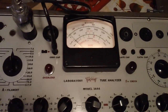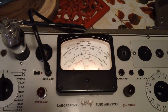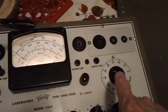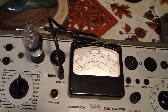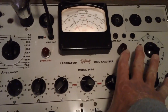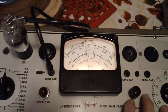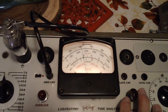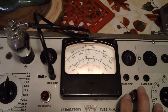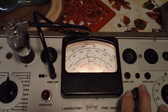It reads really good. It was supposed to read 0.1 to 1.1 or something like that — it's way up there, it's real good, we're in good shape on that one. Now, according to Norm, a small voltage change on the grid should cause a large movement in the needle if it's a 77. I'm going to pull this knob with my thumb and then just barely move the voltage wheel with my finger. I'm at 14... now 15. Nothing's happening right now — it's going down a little. Let's go the other way. Down to 10. Not a whole lot of movement there. Kind of strange.